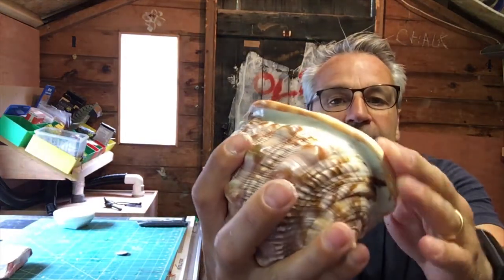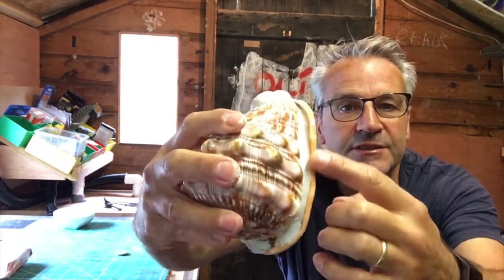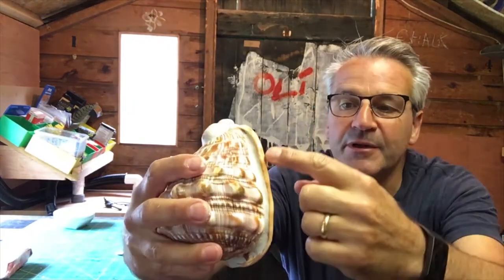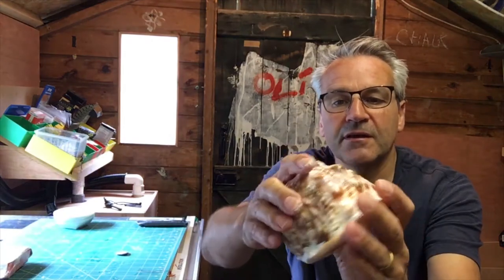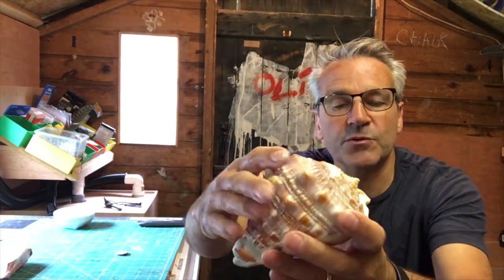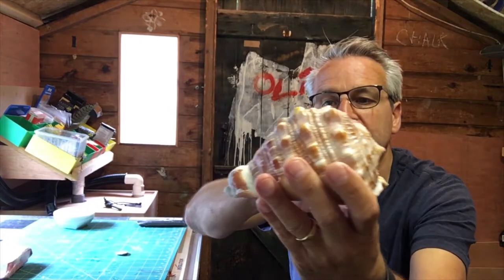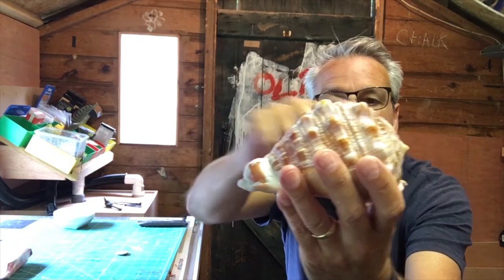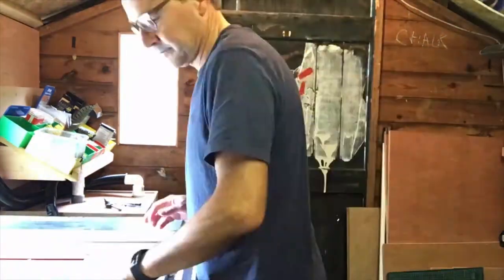Okay, so I have filled in the base, tried to leave some of this texture there because it's quite important, and also gone around that ridge and had to create my own version of the end there. Unfortunately it was just a bit too gnarly — sorry to sound like Jamie Oliver — so I had to fill that in as well. I'll lose a little bit there but there's plenty of texture on the top so I think that'll look really nice in lead. One of the difficulties I'm going to have is how do I align my mold — where is the half going to be that we split the key keeper? I'm guessing just below this point here, probably from here to just below here. I think I should be able to halve it there. Yeah, fairly happy with that. Now let's get on and make the molds.